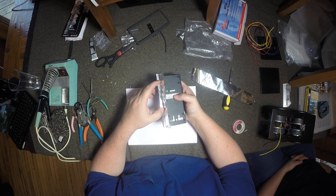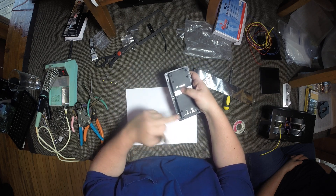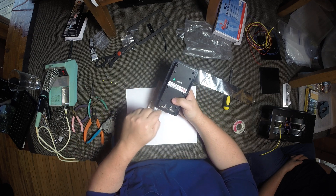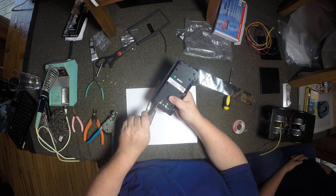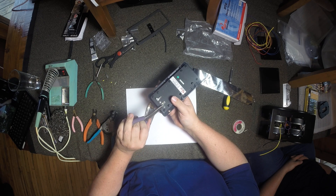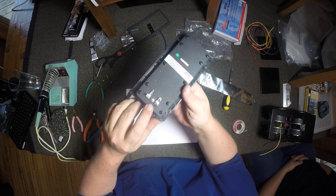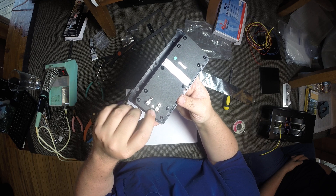Once you peel the tape off, it's going to be sealed all the way from there up and around over top of the screw heads. That seals the edge, the plastic piece, as well as all the screws. Now, the only thing you really have to be careful of is your terminals — you don't want the tape touching your terminals because that will short things out. Either cut the tape around the terminals, which works, or what I'd recommend is very carefully take the terminals and bend them straight up. The outside ones are the ones you have to worry about. Even if you break one off, it doesn't matter — you've got another one right there. Bend them up out of the way so the tape can lay down flat right up against the terminal and you don't have to worry about anything shorting out. The positive is the larger terminal and the negative is the smaller terminal.